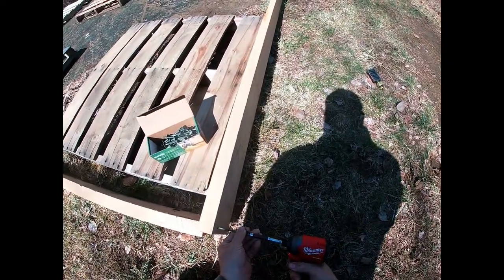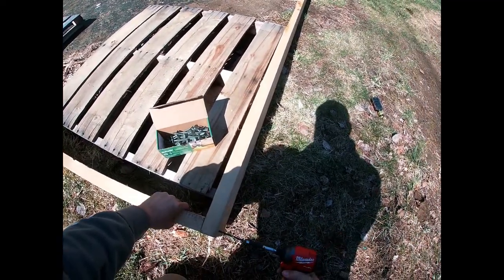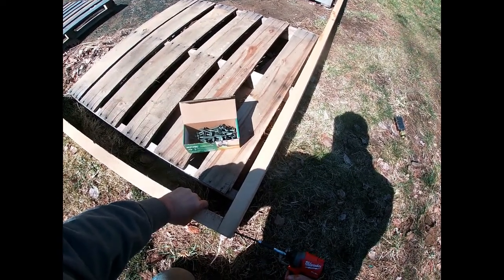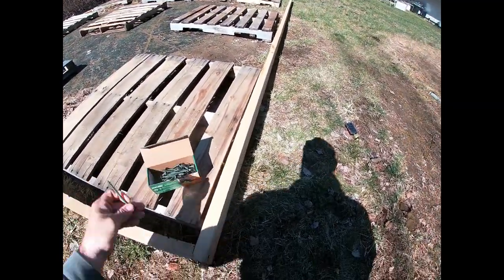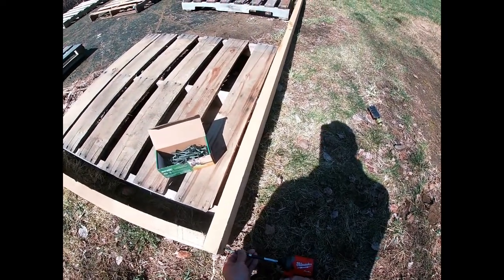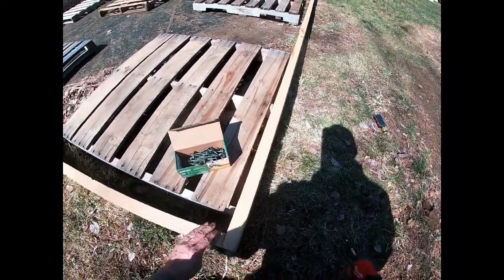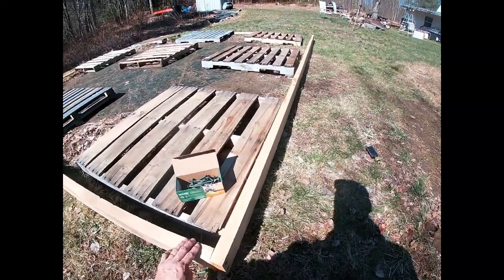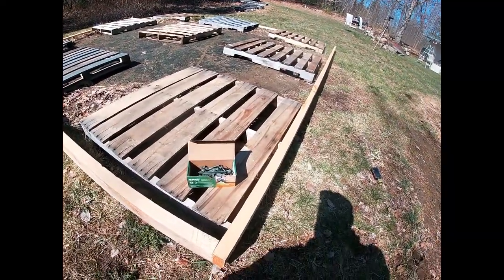So what I like to do is get at least started, just like that. Now, flush those corners up, go about midway. Ooh, very nice. Okay, let's go for the second one. Right here, make sure we got enough meat. We don't want anything to split. Now, I just want you guys to see how tight this seam actually is. It's nice and flat, good penetration, good sealing. All right, so now we just got to do that to all of them.